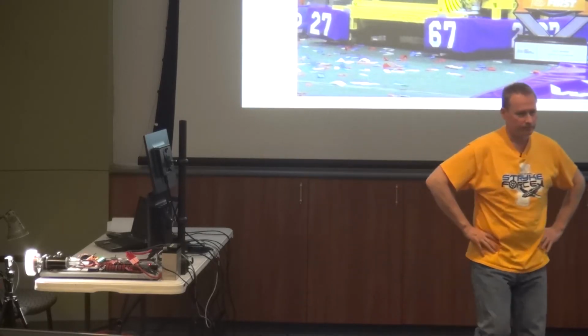And our experience is the copper is not a problem. It's the brush. The brush assembly is your weak link. The copper is actually pretty happy, especially with a little bit of airflow. If 30 amps was your max and you're spinning, you could run those 775s forever. If you are stalling them, or if you're running them in the 50 amp range, there is a stopwatch running during both of those events, and it ain't a big stopwatch. You said the limit they put on those was 5.0 or 1.5? 5.0. Yep. During the road season, 2017.